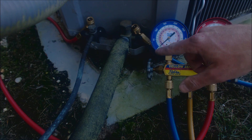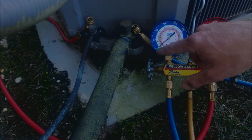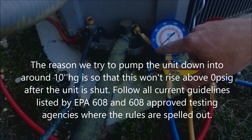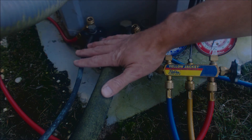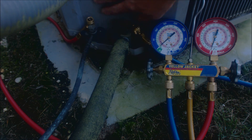If we are unable to pump it down, we're going to end up recovering the rest. If the compressor is not strong enough or we don't get it low enough into an inch HG vacuum — there are no leaks on this system. If there was a leak, we would only pump this unit down to zero PSIG. Pumping down means we're taking all the refrigerant from the outdoor unit, the line set, and the indoor unit and trapping it in the outdoor unit, locking it down with these valves right here.